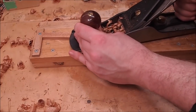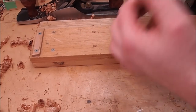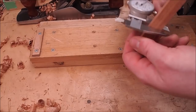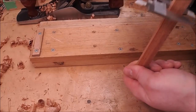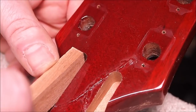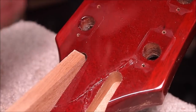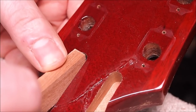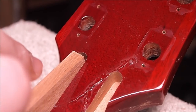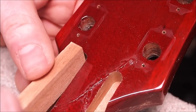People have asked how I make the splines. There's really no trick to it - just start off with an oversized blank of mahogany and plane it down until it's the correct thickness. In this case I'm at 5/16th of an inch, so that should be around 312 thousandths. I'll go slightly oversized and then fine tune my fit - not so tight that I have to push firmly to get it into place, not loose either, it just fits perfectly. It's also a characteristic sound - when it's just the right fit, you sort of hear the wood fibers brushing against each other as it glides into place. If this was too tight, the spline will absorb water from the glue and expand, and in extreme cases you could crack the headstock from the spline up into the lower tuner hole.